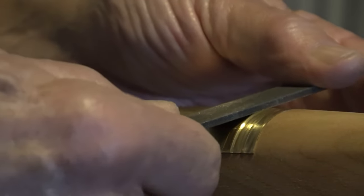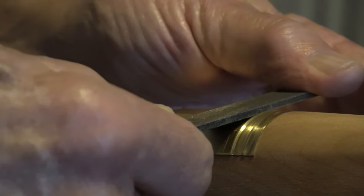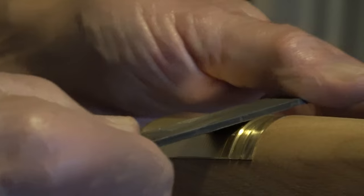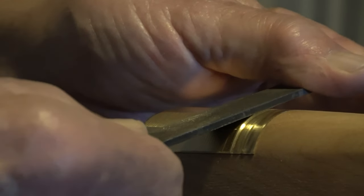And that includes working this brass down, getting the milling marks out of this butt plate. And it's got good flats in it, and I definitely want to maintain those. Sort of an octagon look. You come right up against this fine work, the grooves, then the little ridges. So I want to maintain all that. So I'm coming carefully right up against that, and get rid of all these milling marks. Like I said, I'm in no hurry. Get it done.